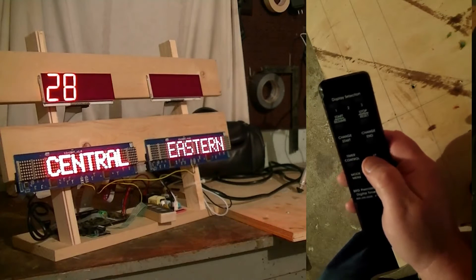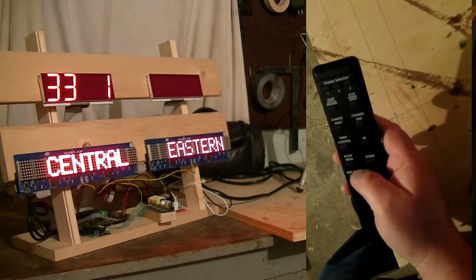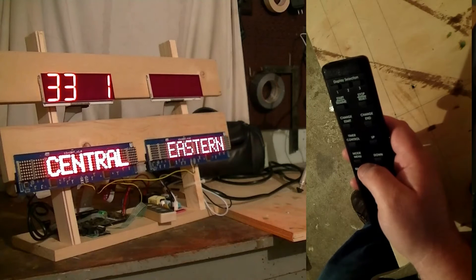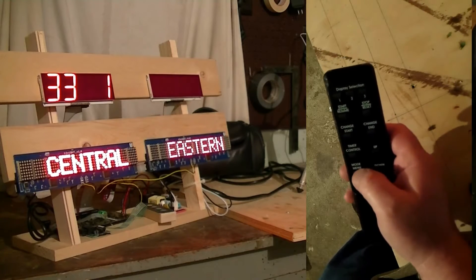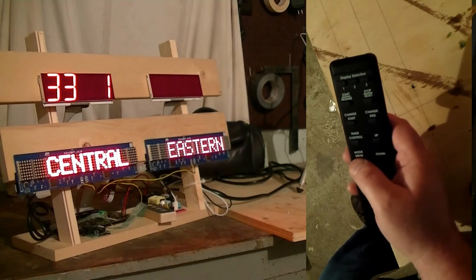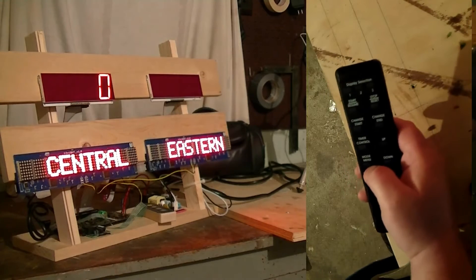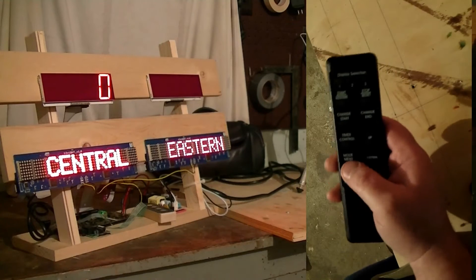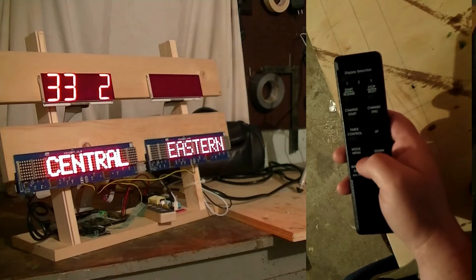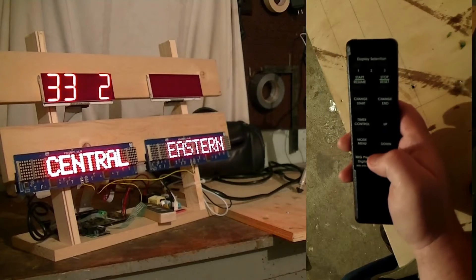Let's go up to 33, mode menu one time. Mode 33 is where you can set an additional 15-minute offset — you can do 15, 30, and 45. Right now we're looking at time zone number one and it's set to zero, which is correct — we're setting this up for Pacific so there would be no additional offset. We'll go up to time zone two — also correct. For Zulu there would be no additional offset.